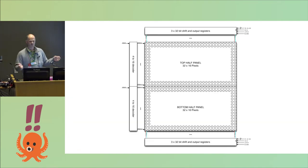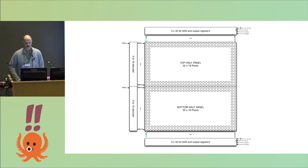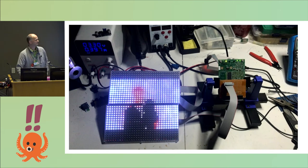Now we have everything in place for the cube: cheap electronics with LED matrix panels and a potential way to handle mechanics. LED panels have a weird interface called HUB75, and if you want color shades, you need pretty precise timing to control every LED in a serial format. FPGAs are really perfect for that, so I designed an FPGA driver for it, and also added a soft RISC-V CPU to provide the pixels and get your image. This is basically the hello world of LED panels, with the FPGA driving a custom prototype board.